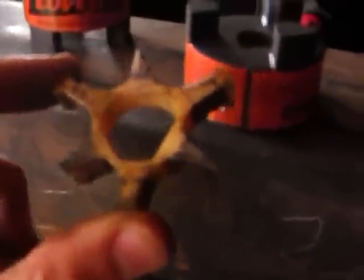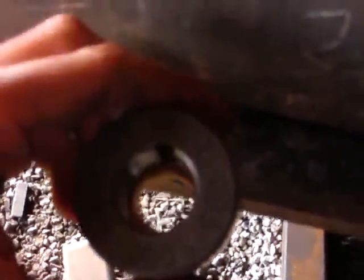Let's get this rubber ring back on. So here's the motor shaft, and there needs to be a 1/2 inch gap between the pump and the motor shaft to make space for the plastic, because this coupler is going to go between the two. There's a plastic spider. This is actually an old one, but it's going to work just as well anyway. And it's 1/2 inch tall. That's 1/2 inch. And if we look here, the shaft of the motor will go down through there, and then it can't go past the spider, else it'll damage it.